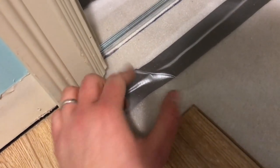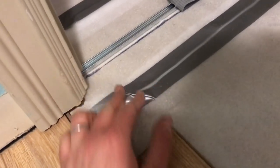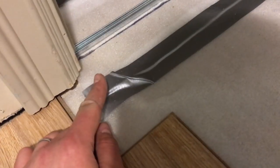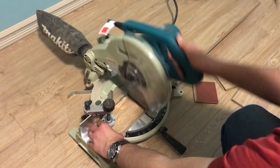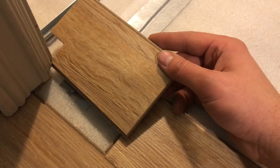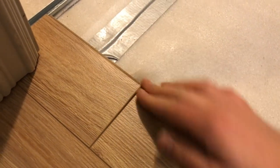This spot is going to be a little bit tricky. I have to measure down to my metal rail that I put in, which holds the joining strip. It is 6 and a half inches, and then I'm going to have to notch it so it'll fit underneath the door jamb. I'll cut my length first and then notch it after. And there it is — I've got my notch cut out, so hopefully it fits in perfect. Like a glove!